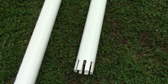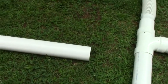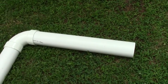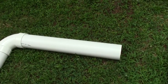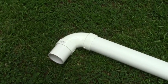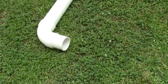So then it fills up the tote until it gets close to the top. What comes in, we've got to let it come out as well. So inside the tote is our overflow diverter. This pipe here, which is just open and quite long, extends to the opposite corner of the tote. We're trying to get that water to move across the tote — forcing it in at the bottom on one end and out at the top on the opposite corner. It comes through this elbow, we're exiting the tote through the side and then out. We have some type of extension pipe here, and we want to force that overflow away from the house. I'll probably put a longer pipe to get that water further away from our foundation.